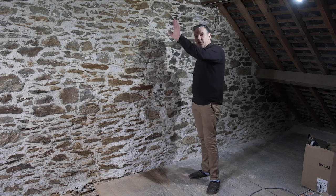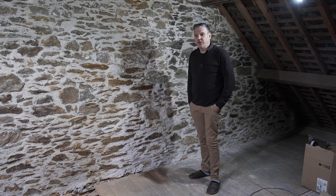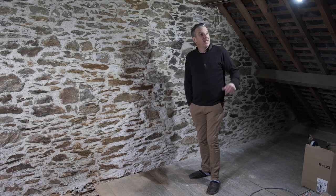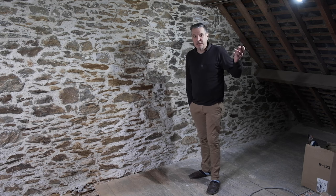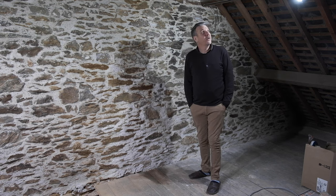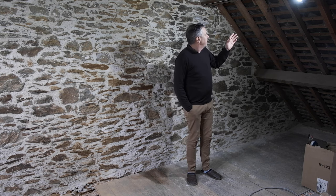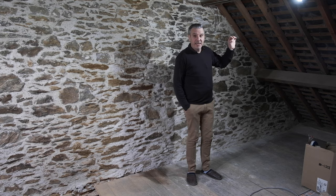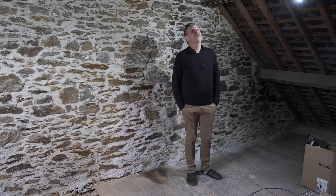So we had the rear half of the roof replaced because it was an old ancient slate roof, very heavy and very damaged. But this side of the house was a newer roof, relatively speaking, but it's still pretty old. And what we've got on here is the roofing tiles have these small spots of what is probably iron in them, and it sort of rusts, it oxidizes, and that makes the tile become weak and it cracks through. And they're a lot more fragile than we originally thought.